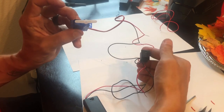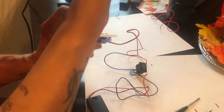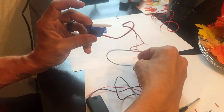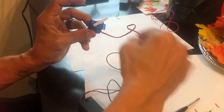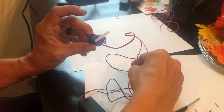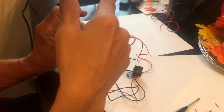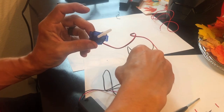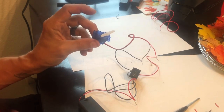Very simple way to do this. Now if you had the Iron Man faceplate — it's got the arms, basically the 90-degree arm — I'll show you on the helmet that I have displayed here. But this is all there is to it. You've got your battery pack, you've got your switch all wired up, and you've got your servo motor hardwired. You don't need any code, you don't need to do any pinning, you don't need any extra headaches. You need a battery pack, a servo motor, the mounts, and then you slap it in the helmet and you can open and close it. You can put the switch at the base of the face and just reach in and turn it on and off — that's what I'm doing with mine.